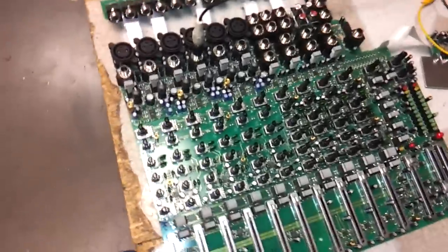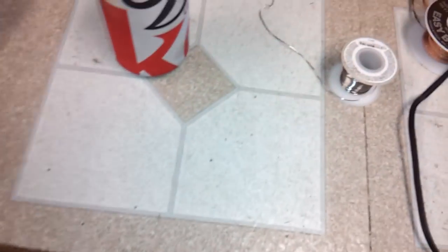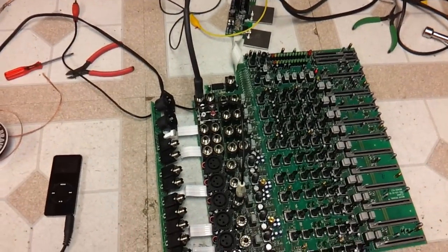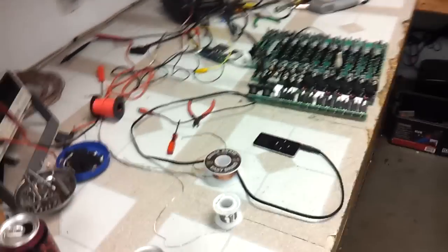Without having to mess with the masters, the mains. Went through all the channels — everything appears to be working, so there are no other failures. The only thing that came up was that bad capacitor. Another case of those little multi-layer ceramic capacitors shorting out. I've seen so many of those — it's ridiculous. There are no other apparent failures, no semiconductor failures. It's just those capacitors.